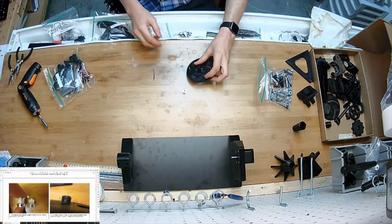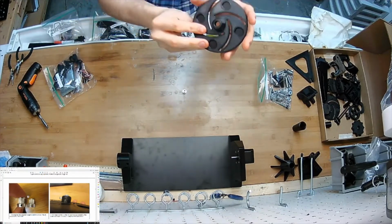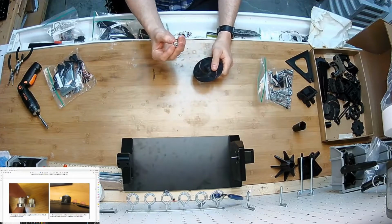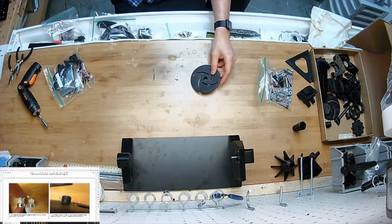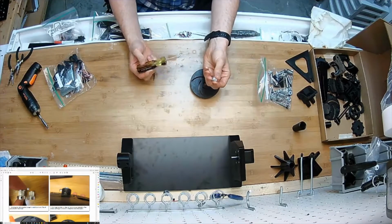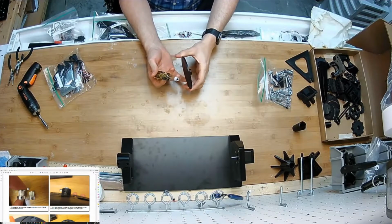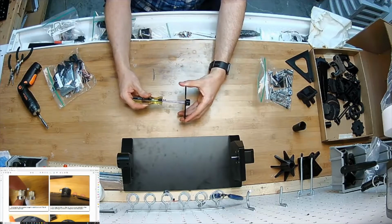And I'm going to dig out the chuck piece. It's the only one that looks like this. It's got this little spline built into it so that it's going to mate with this part perfectly. What this is going to allow us to do is affix the chuck to the motor shaft with two set screws in a way that's permanent. It's not going to jiggle off, and that's what's necessary. So we are going to use our screwdriver, and the set screws are actually pointing into the hole right here. That's going to help us. I'm going to put it through here, put it on the end, so I have control, and then look at the side from my view right into this hole so that I know I've got them lined up.